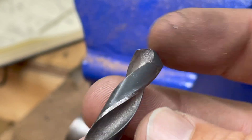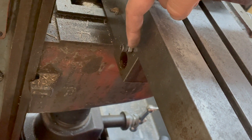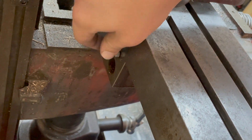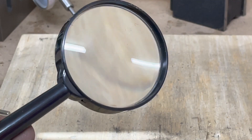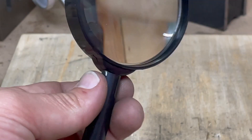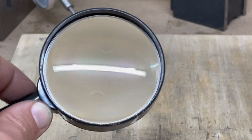This is one of the locks on the carriage for the table for the mill, which I only discovered recently. That's going to help me when I'm machining the bogey stretcher to have nice straight cuts. I am now going to take full opportunity of this cheap magnifying glass — I made that mistake in drilling where I didn't see exactly where the drill was going. This is a six times magnifying glass, so I will be using that to double check all my scribed marks.